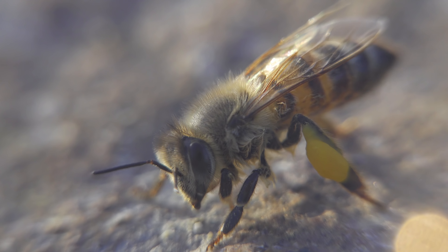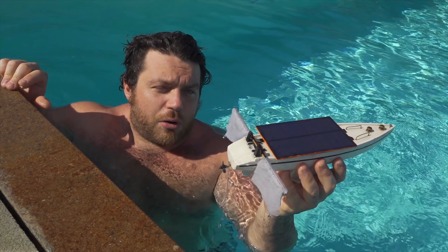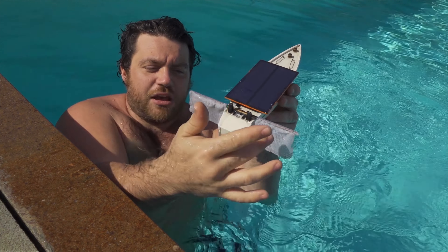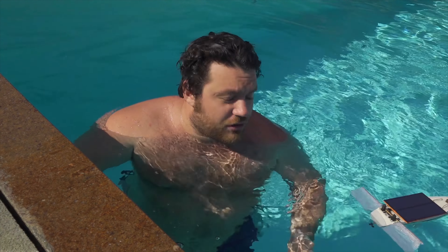And this, finally guys, is the end result. I'm very excited because it started as just an idea in my mind and became reality — and it works great! I put fabric with a lot of holes on the back, which is great because insects have little hooks at the bottom of their legs so they can grab onto the fabric and save themselves from drowning. I also put silicone around the motor and all the electrical connections, so now the boat can almost go underwater without problems. The fabric on the sides also works great as a stabilizer — it keeps the boat very, very firmly on course.